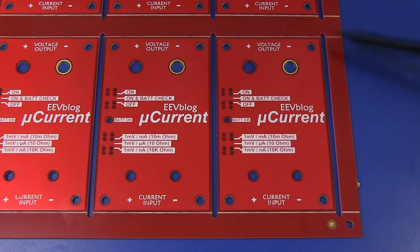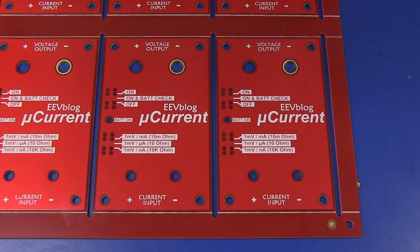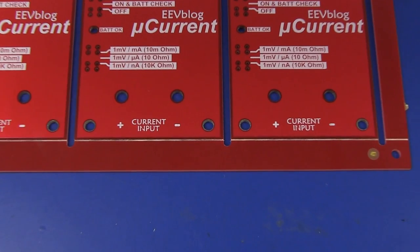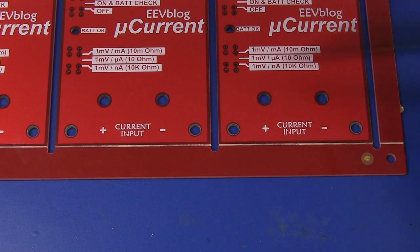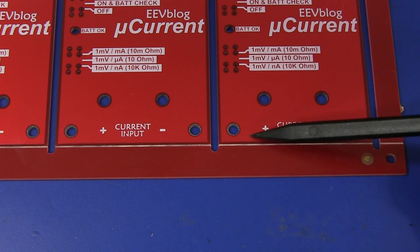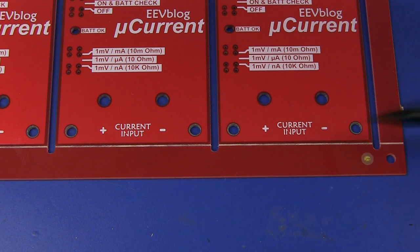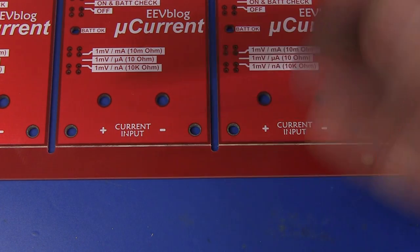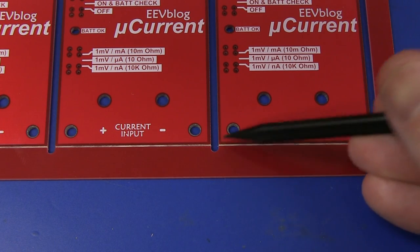When you get a panel manufactured, a panel is just part of the PCB. You can put traces, circuitry, connectors, and all sorts of stuff outside your product to get signals on and off your board. But with my old boards I used V-grooving — which is cheap and simple, you can just snap boards off — but you can't route signals across there because the V-groove wheel just cuts all your traces.